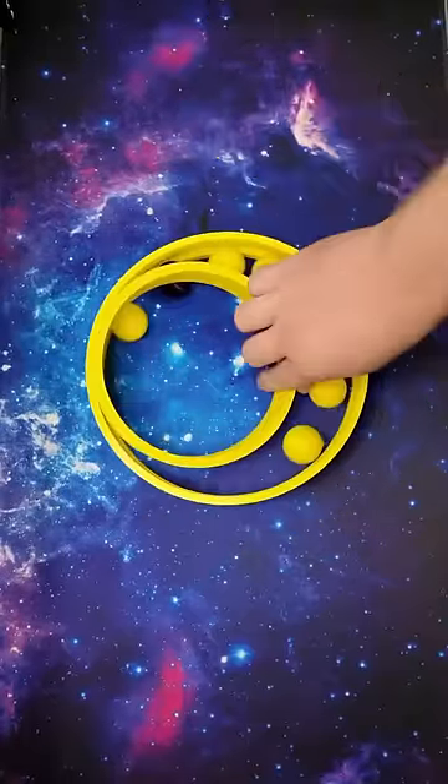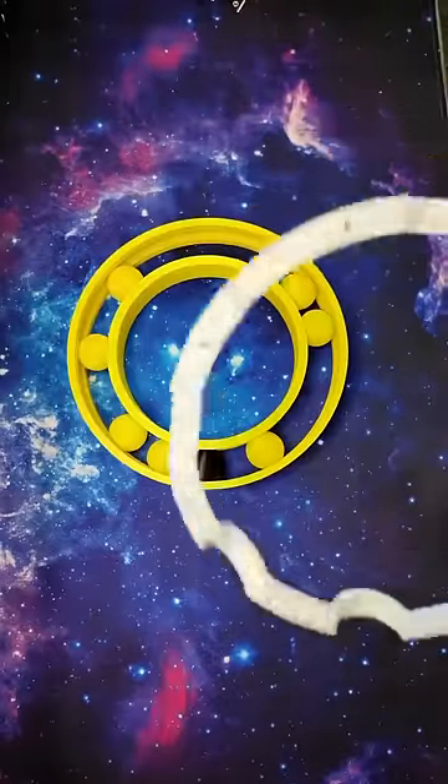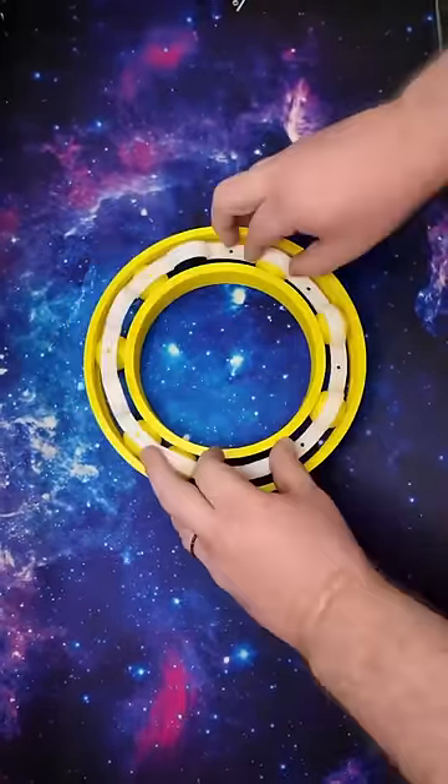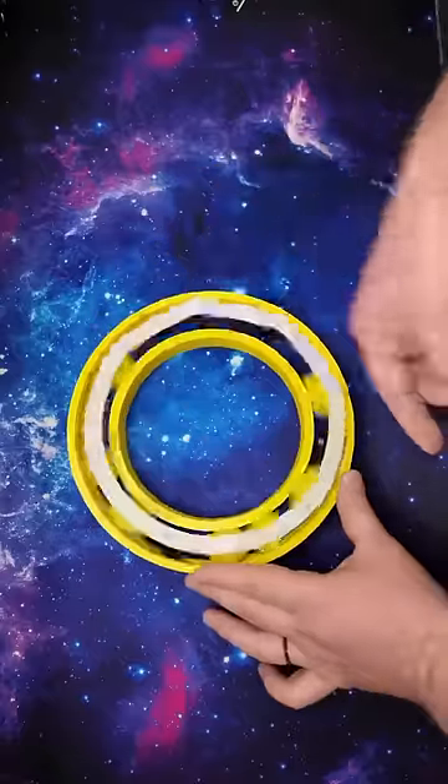It's really easy to get the balls in place when they're loose like this, but there's no guarantee they're not just going to spill out at any moment. The thing that I feel stupid for not knowing is that there's a ball carrier that actually sits on top of the bearing balls and keeps them evenly spaced, as well as prevents them from sliding out of the housing.